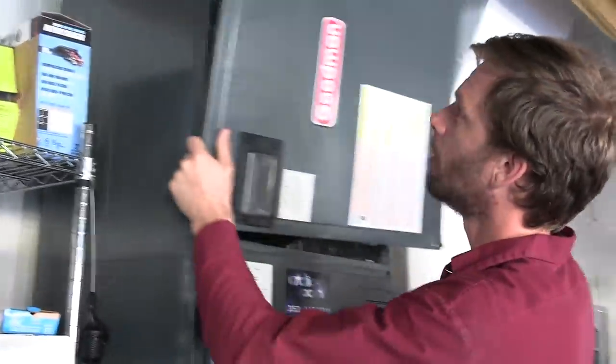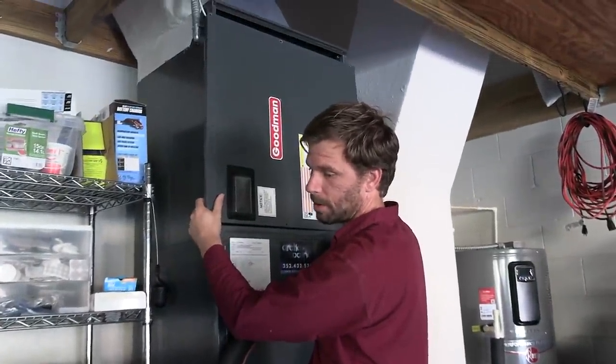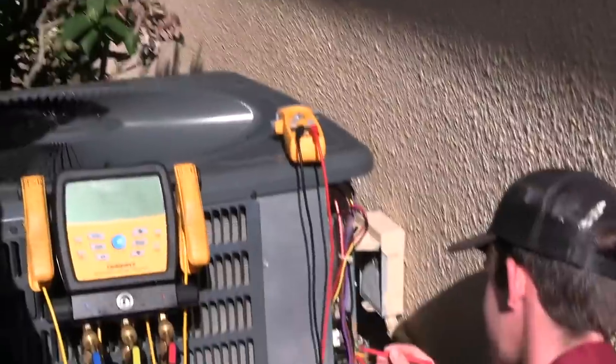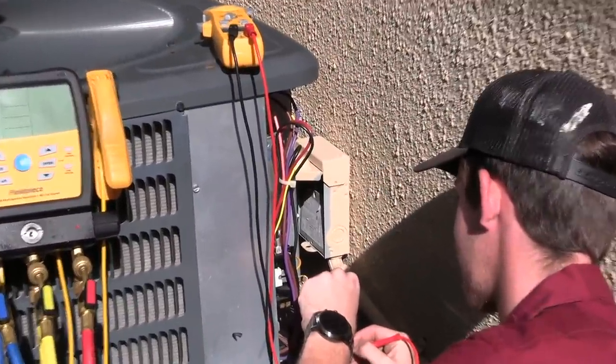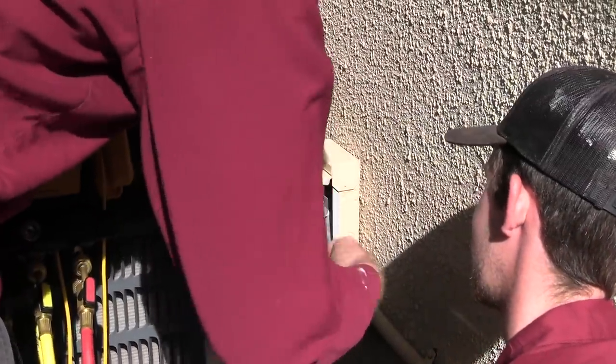Already we're noticing a couple of problems here code-wise. You actually need the ability for your backup heat to be able to heat the size of this house, and 5kW is not enough. It says zero volts — that's right. Checking to ground is the only way to actually check safety. If you've got zero volts to ground, then you're safe to touch because you are ground.